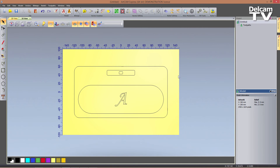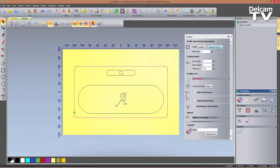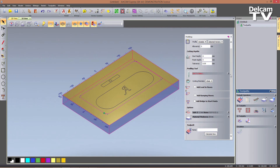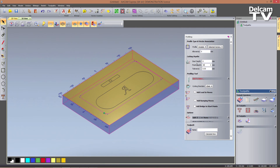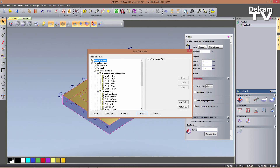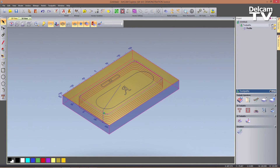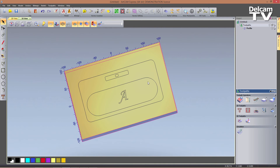So I'm going to select a view from the top, and the first toolpath I'm going to create is my profiling one — the one I will use to cut the part out of my block of wood. So if I click on the most external vector, I can click on toolpaths and select a profiling one. In this case, I want to profile outside the selected vectors. First of all, let's set the material to be 30 mm thick, with the material at zero and the model position on top of my block. I can now select my finish depth, which is going to be 30 because I want to profile all the way through. I'm going to use the 10 mm end mill. If I'm happy, I can click on calculate now, and the toolpath has been calculated. I can now make this toolpath invisible and start to think about the other toolpaths I need to create.